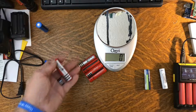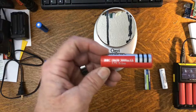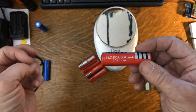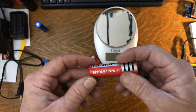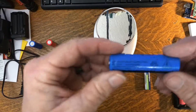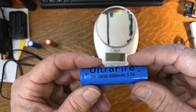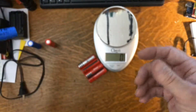For me personally, these cells work fine. When I say counterfeit, basically what I'm trying to get across is that they're mislabeled — I've seen some that say 9000 or 9900 milliamp-hours. As far as I know, 3400mAh is the biggest capacity confirmed, though I've heard one company is making a 3600mAh cell. A cell like this one claiming 4200mAh won't run my flashlight for any length of time — it runs about 10 minutes and it's done. It does recharge and comes up to 4.2 volts, but I get almost no life out of it.